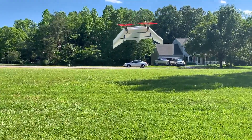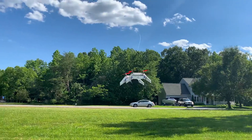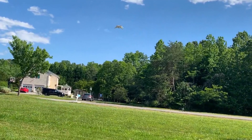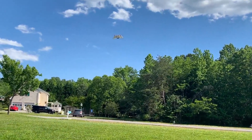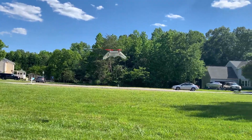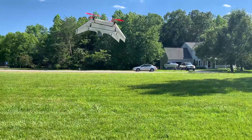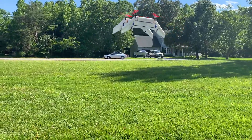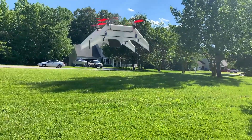So let me put this into half forward flight really quick — I'm not going to do a full transition. Now I'm going to do the same thing except halfway through that transition I'm going to flip the switch that basically turns it into an airplane, flipping the aileron and rudder control.